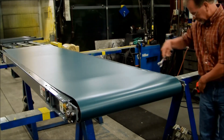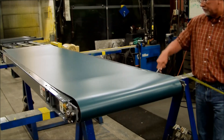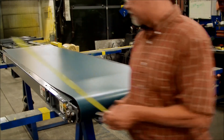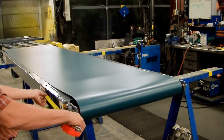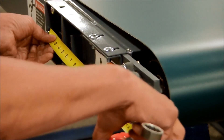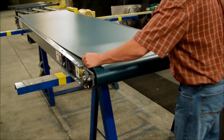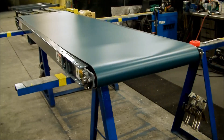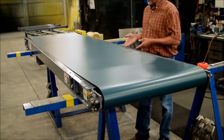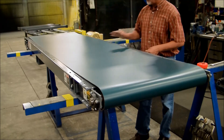I'm going to move this one first. I'm going to go a quarter inch, so I'm going to go to sixteen. And I'm at sixteen on this side, and I'm going to do the same thing for the other side and bring that to sixteen. Now we're at sixteen on both sides. I'll check my belt tension — it's on that pulley nice and firm. I'll also slide my hand under here and make sure I can get my hand width under there. It's a little bit snug, not too tight. I wouldn't want it so tight that I can't get my hand in there. That looks pretty good to start out.